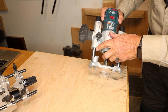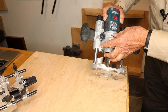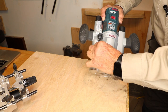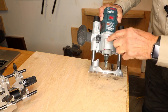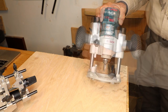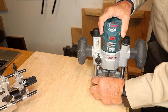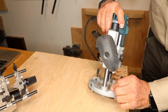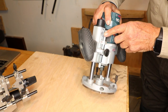The first step is to take this little micro adjuster and turn it so there's a small gap — we don't want it all the way up to the top. If it's all the way up, we won't be able to do a micro adjustment later. With that in place, find the lowest spot on your turret and get that underneath the rod.